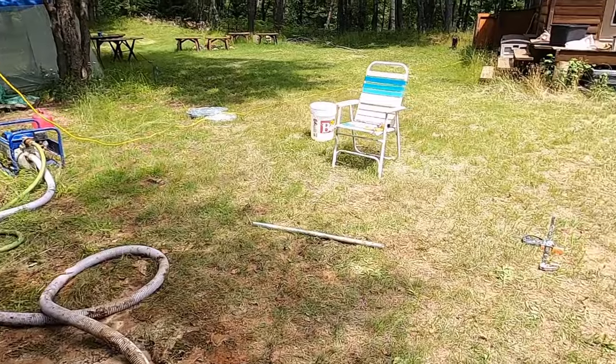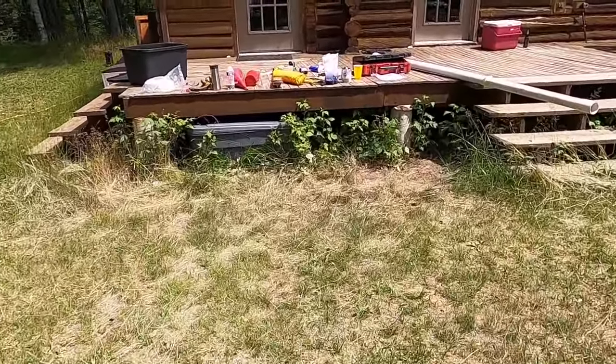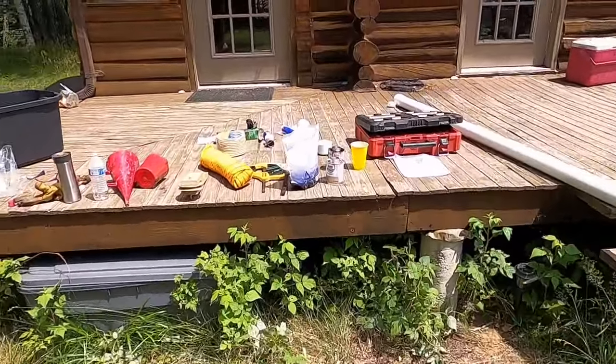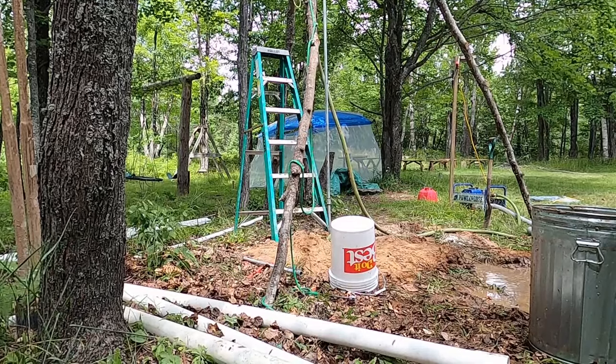I just did the marsh funnel. I was right at like 40 or 45. They say 40 to 50 for this kind of sand, so I'm gonna call that good. Let's get started here. All right, we're gonna do this.